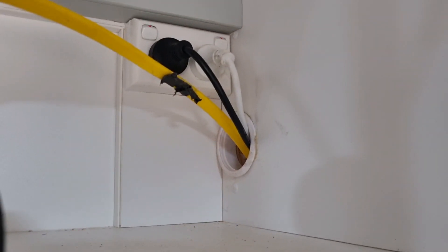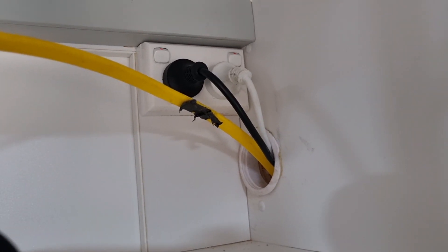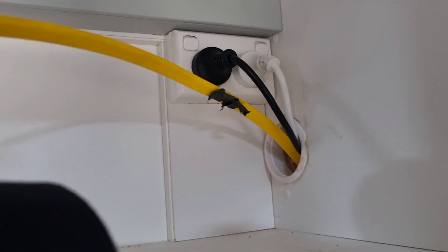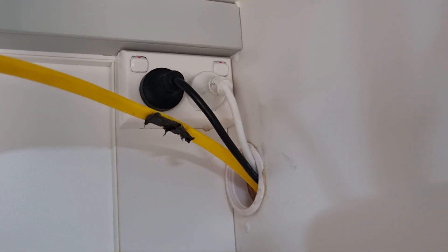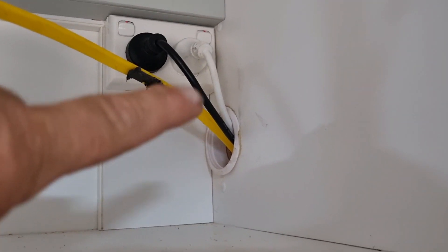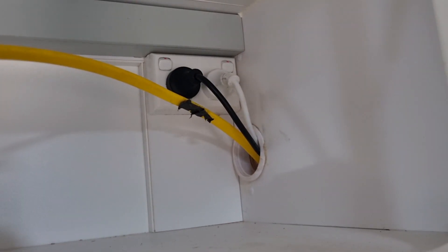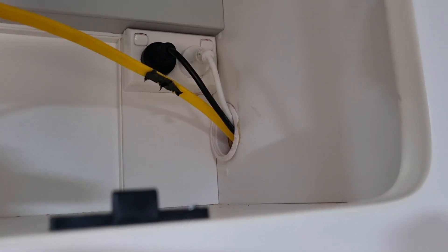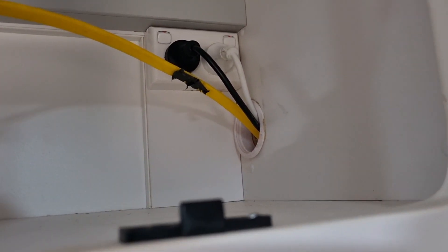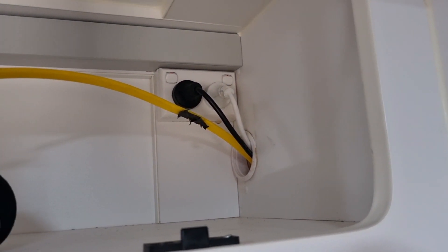You feed the yellow tongue down the hole and just play around with it — it's a little bit tricky but not too bad. Once it's down there you can pull your cable through. If you don't have a yellow tongue, you could tape your cable onto the existing white lead and pull it up, but then you've got to get that lead back down again. You do that by pulling heaps of slack up and then pulling it back down.